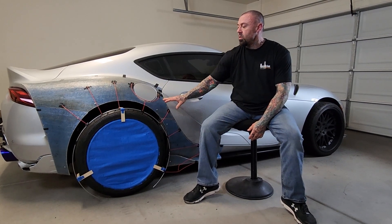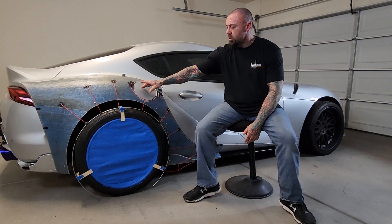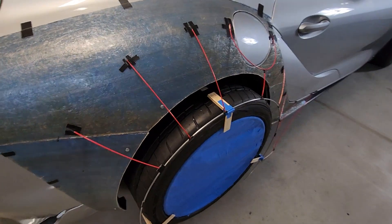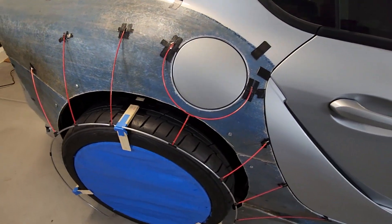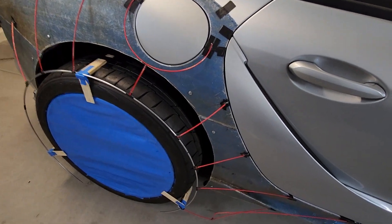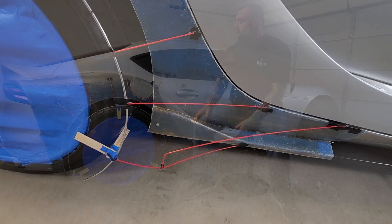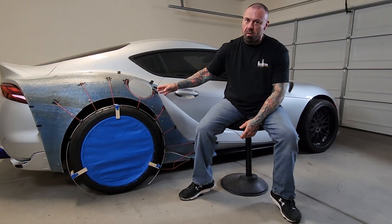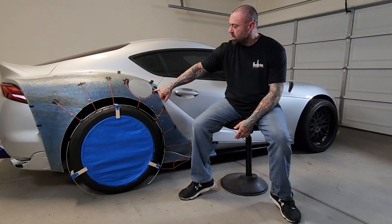Right now I painted them red — hopefully you guys can see them. What I do with the glossy finish is look at the reflection of the light off the gloss, and it really highlights the curvature of what I'm bending, or what I have bent after it's actually in place. So right now what I have is simulating my cut line into my fiberglass. These are my ending points.